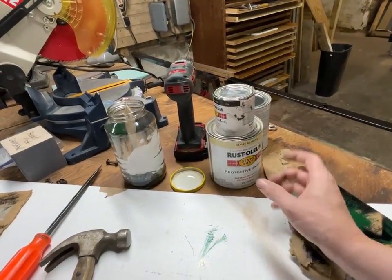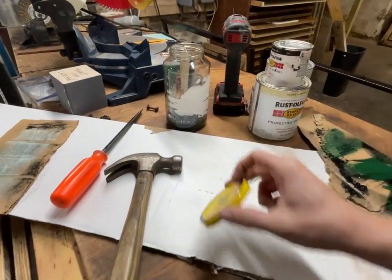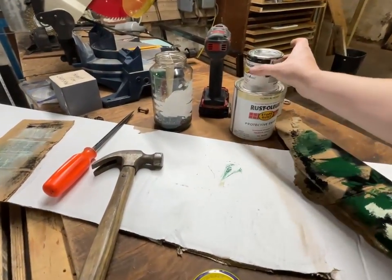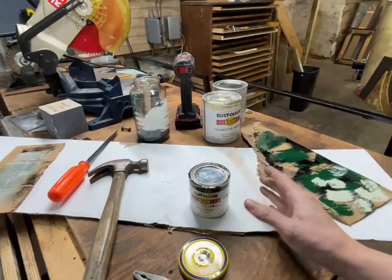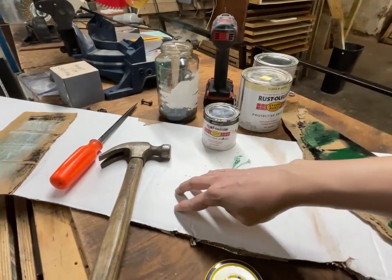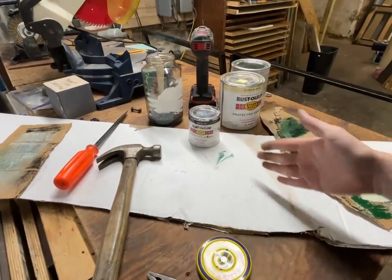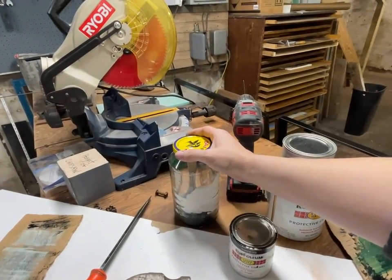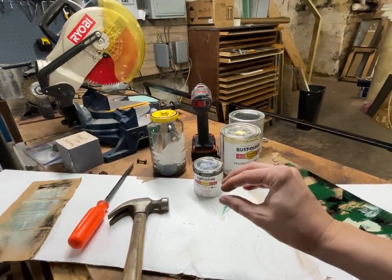I should have heated these up more. In a future video, you may see that I'll get one of those heating elements that's designed to put your tea on, and it keeps it up to like 110, 120 degrees. I think that would be perfect. I turn it on and let it heat up for an hour or so, and then I have nice hot paint. And the hot paint then has like the lower viscosity, so when you brush it on, the furrows left behind by the hairs of the brush melt together really quickly, and you get that nice smooth surface. I had to do something akin to that when I was painting with red pigment, because the red, just like the lighter colors, the pigment has to be very big, and so it doesn't smooth out as fast.